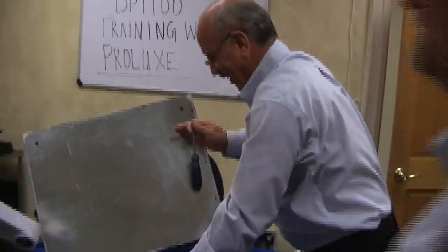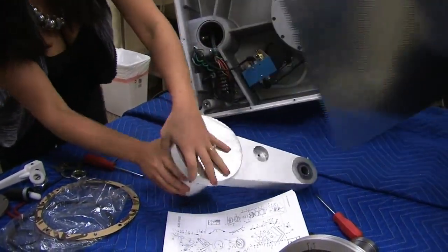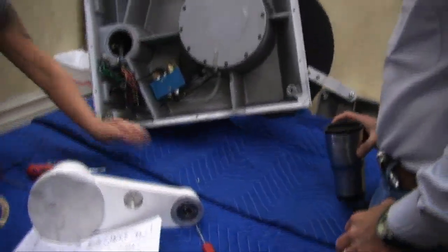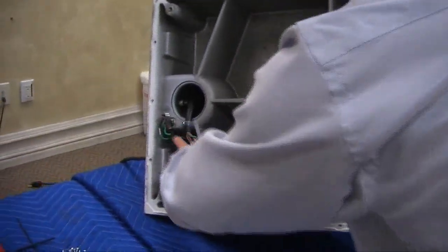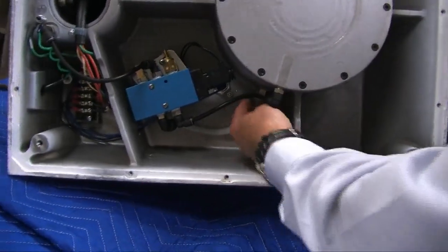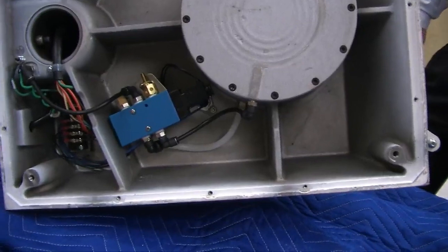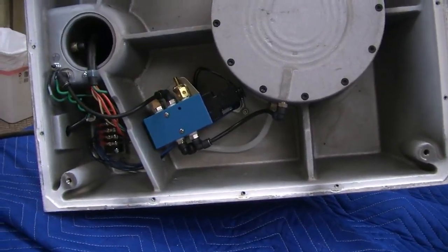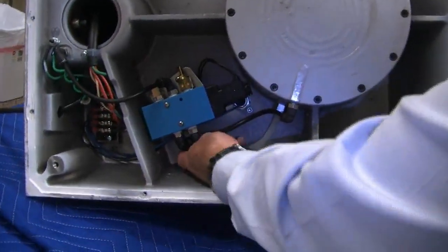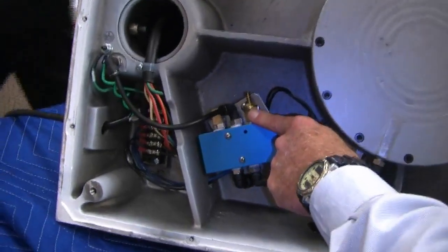This arm right here, this pivot arm, and the two set screws, I'll get to that. Here's what you're looking at when you're looking under here. You have air coming in. This big 3/8 tube is the top air to release the platen from vacuum. That's why we have more airflow going there, to give it a good pop to loosen that up. The exhaust side of that, on this big 3/8 tubing that comes from here, is this muffler / speed control.